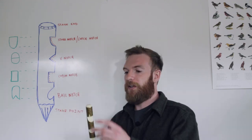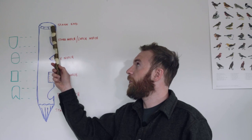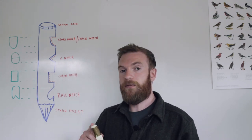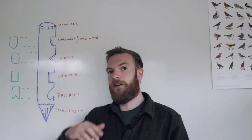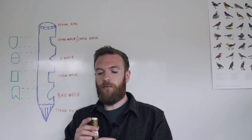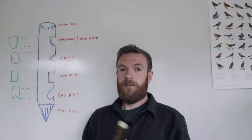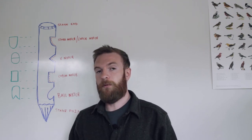The first part of the tri-stick is the very top, which is the stake end. It's simple — all we've done is chamfer around the top of the tri-stick. There are a number of reasons for this: if we were constructing a tent peg, chamfering around the edge is going to stop the wood from splitting when you're hammering it down with an axe or a rock. It tightens everything up and brings it to more of a point so it doesn't flare out.